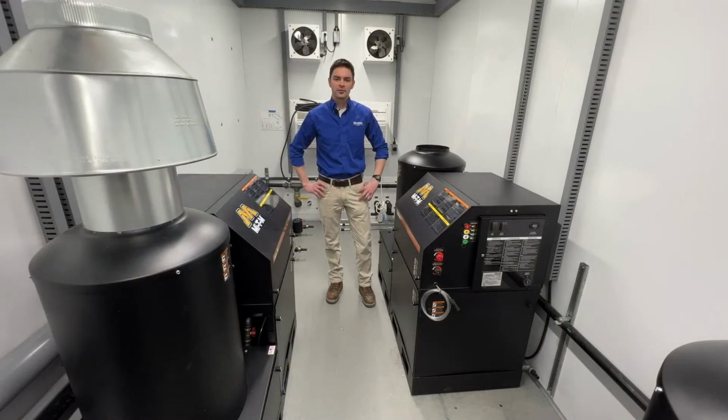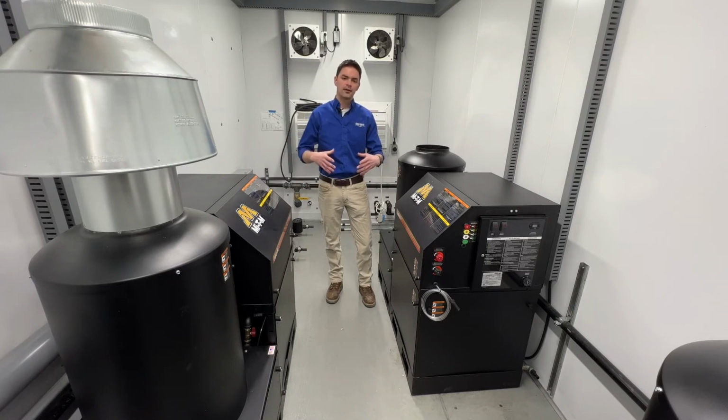Another standard feature that we have in all of our shipping container builds is a durable coating over the floor. We will route the floor on the outside, and we'll run it to a common sump, so that way leaks that may happen over time actually get drained to a common sump and then pumped into a tank. And then we'll coat the floor with a non-skid waterproof coating to protect the wood.